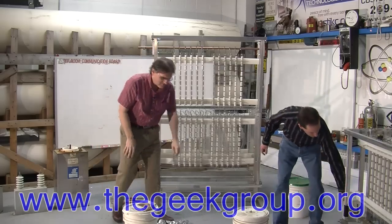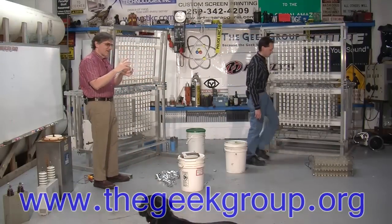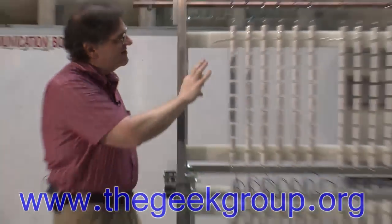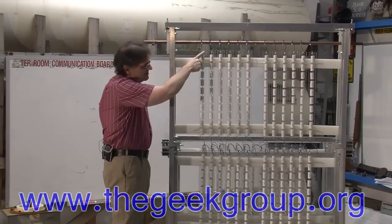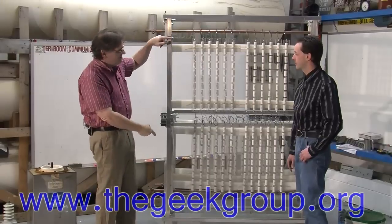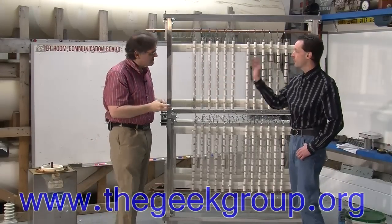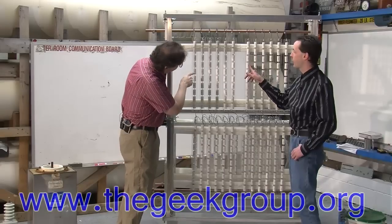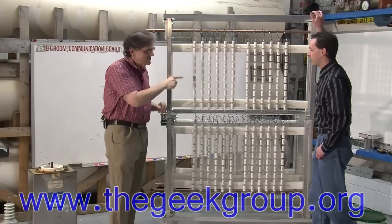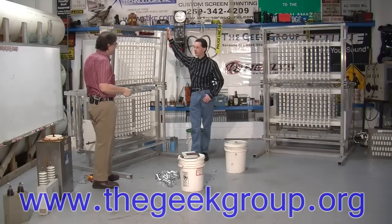You designed it. What we've done is taken some of our MMC caps and constructed strings. 10 here, tied in series with 10 down here. So you have a string of 20 caps. And these caps are a different size than that. They're the same model, the 942C series, but these are the 0.15s. So these are 1.5 times as big as that. It's still 2,000 volts? Yeah, they're all 2 kilovolts. So 2,000 volts times 20, that's 40,000 volts for the voltage on this cap.